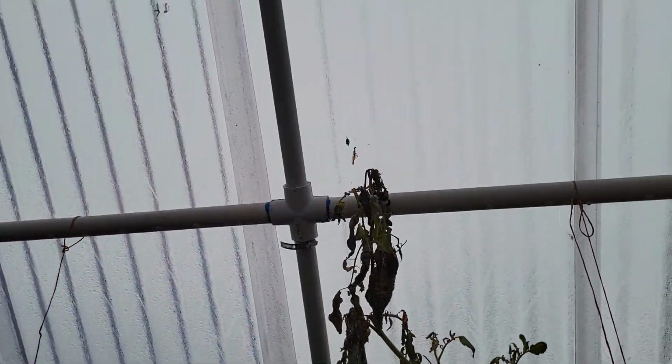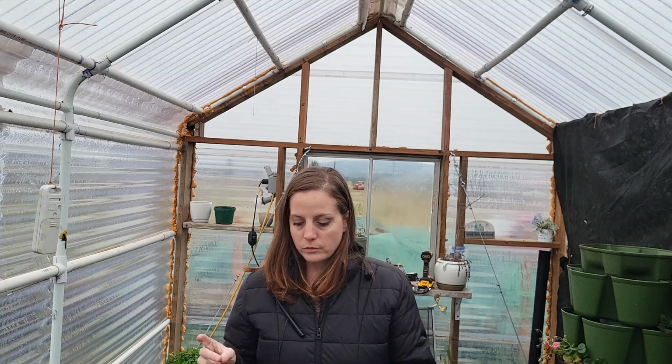With our bottom panel already installed, we decided to just continue that direction with the rest of our paneling. When it came to the roof, we actually decided to take the paneling the other way. That allows any snowfall that we have to be able to slide off the roof. We tried several things in the attempt to cut this paneling to make the peaks of our walls. We used razor knives, we used scissors, we used skill saws. We tried so many things.